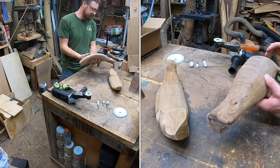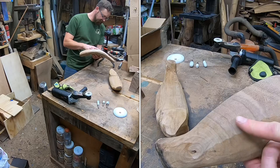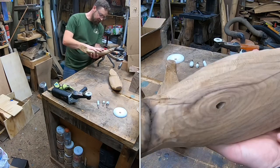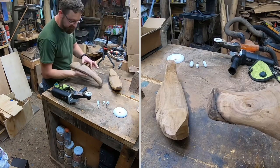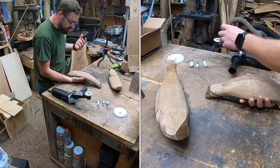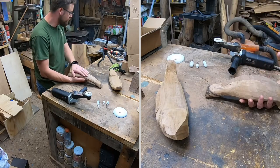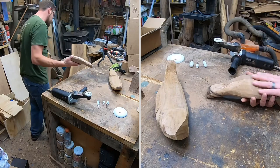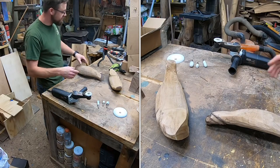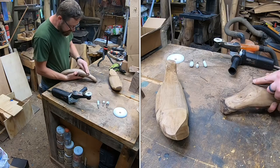All right guys, let's take a look. Bring this in here nice and close. You guys can see where the line is — so this is where it's sanded smooth, and this is where it's still rough. We smoothed out in here, and as you smooth it out, it really brings out the grain. Now, there are still some swirl marks in there from the disc, but that's to be expected — there's a bunch of little teeth in there swirling around grinding away the wood. But the nice thing with the whisper burrs is it's pretty much ready to be sanded once you use those. You could jump in with some 100, 150, or 180 grit and start sanding away.